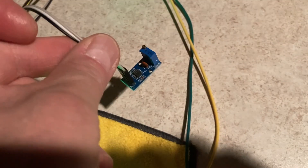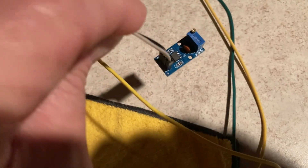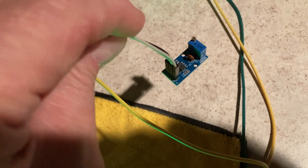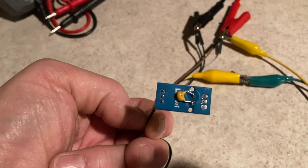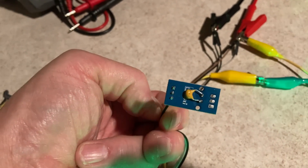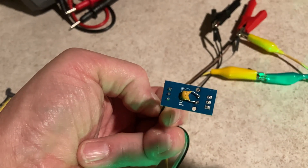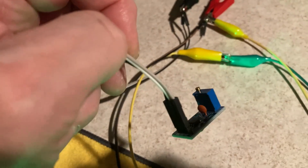We're going to use a simple little circuit here. This is the 555 — that pulse generator I was talking about, you can get it on Amazon. To slow the rate down, I put a 0.47 microfarad capacitor, soldered it on the bottom in parallel with that other disc capacitor right here on top.